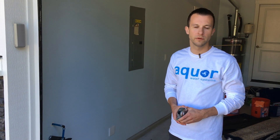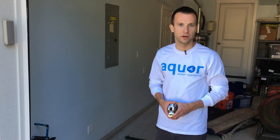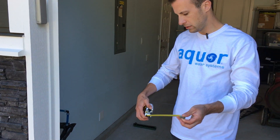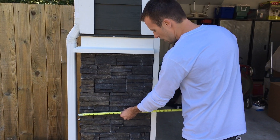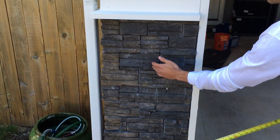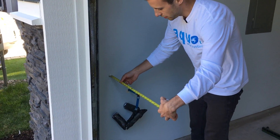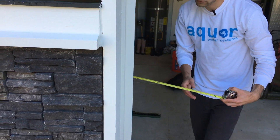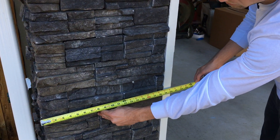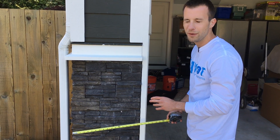For this project, we're going to be using an 8-inch V1 Plus Hydrant. I'll show you how we made that decision before we took anything apart, so that you can go online and order the Aukor hydrant before you even start the project. You can guesstimate or do a rough measurement of how long the hydrant needs to be without taking anything apart. Next to the wall, it's about 20 inches total. The distance from the inner drywall to the exterior wall is about 13 inches, so subtracting that leaves about 7 or 8 inches to the outside of the mounting block — so our 8-inch hydrant should be perfect.